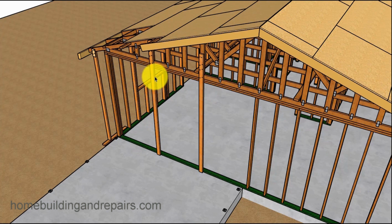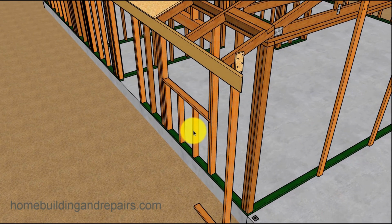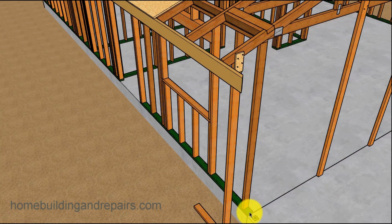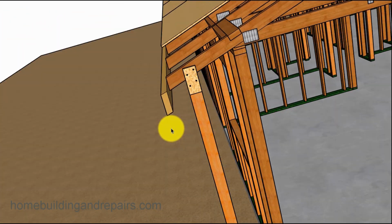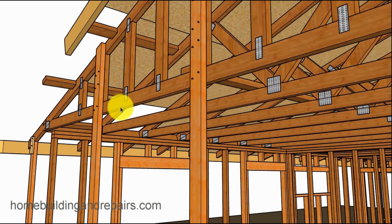And if I was to leave a couple of the support boards underneath, then you could see where it wouldn't work, wouldn't be able to get the beam in there. So keep that in mind. And let's go ahead and remove the corner section here. And of course, this will be the area where we're going to put our support post. I'm going to put a 4x4 in there, give you an idea of what this would look like. You're going to have to cut this also if necessary. Got to make room for the beam.